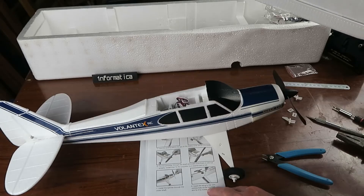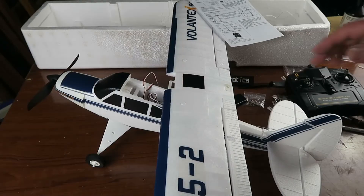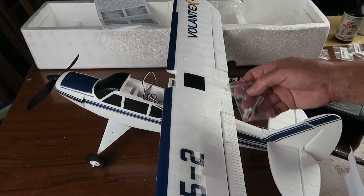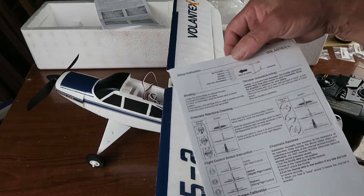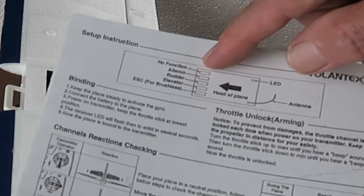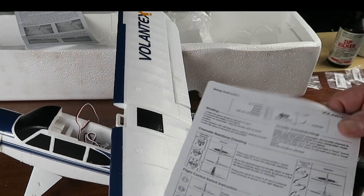It then says to insert the wing. I would guess that you need to install the aileron harness first, otherwise that's not going to work. Before we put the wing on, there are other jobs to do which the instructions make no mention of - we haven't put the control horns or the control linkages for the aileron servos yet. The ailerons need to be connected to the receiver inside. There's a little addendum sheet because this is a new receiver. This is in the correct orientation towards the front of the plane, so on the outside there's no function, and the next one in next to the rudder is the aileron. So you put the extension lead in there onto the aileron and then connect the two aileron servos.